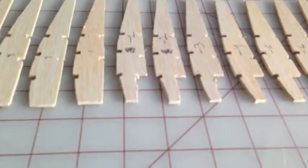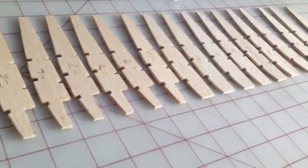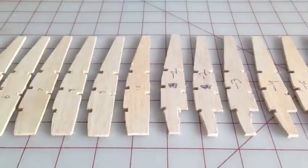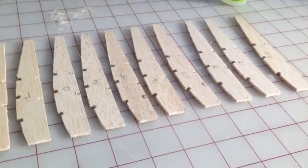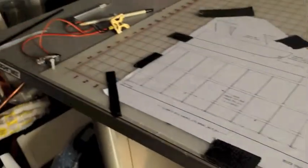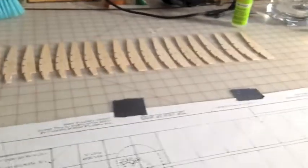These are all 30 formers. I assume the secondary formers are going to be in the center to make room for the plywood spar. So I have the 10 out of the 20 on the left side, the middle 10 for the secondary, and the remaining 10 for the primary ribs on the outside, which are all going to fit into this wing plan, which in the end will be 46 inches. Now I have to lay everything out and make sure everything fits.